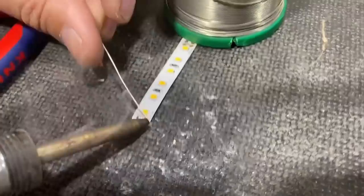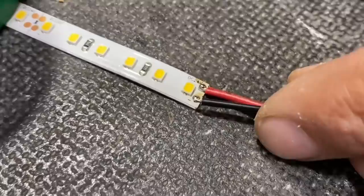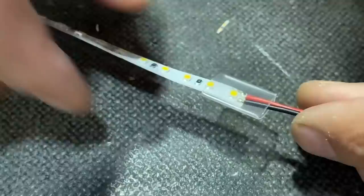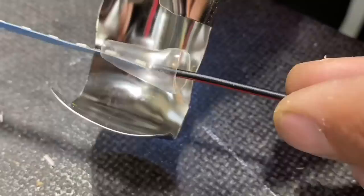Challenge time — let's look at soldering as a comparison. I'm using some Robus Vegas LED strip here. Soldering is incredibly easy when you're on the bench, however on site it's more of a challenge. We'll just tin our wires, tin our pads, and bring the two together. If you're not confident soldering, I would not recommend even trying — you can see I'm shaking away there. I'm liking the first method a lot more already. It's exactly the same process with the heat shrink afterwards.